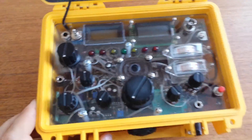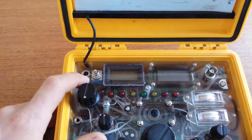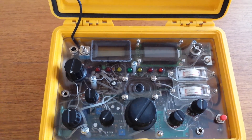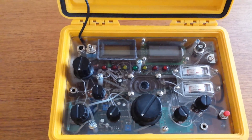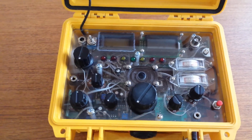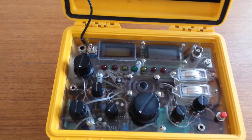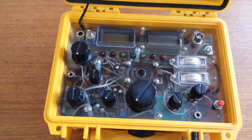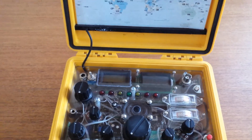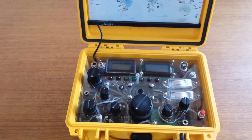There's so much to go over here. Here's the charge port — that's where you plug in the AC adapter to keep the battery charged up. It has a built-in 4800 milliamp hour lithium-ion battery claimed, probably more like 3000 milliamp, and it lasts for quite a while. The current drain on the SW is very low — in fact, you can run the receiver directly off the solar panel with no battery in full sunlight. A full charge will get you a couple of days of casual operation outside, and with the trickle charger you should be able to maintain it indefinitely if it's in the sunlight long enough.